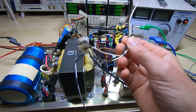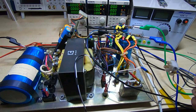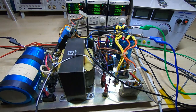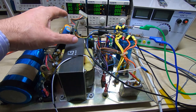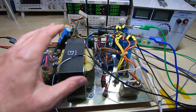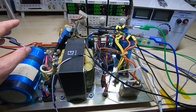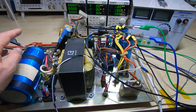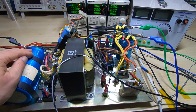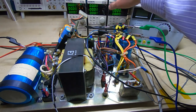I've also replaced some of the wiring that had been hacked about and tidied things up. I've given the supply a really good clean and done some static testing with a multimeter to make sure it all buzzes out correctly. In theory it should come to life, but I haven't tried powering this up yet. I don't know when it was last powered up, and I don't know if these capacitors will withstand voltage — they measure okay, but the only real test is to put power across them.